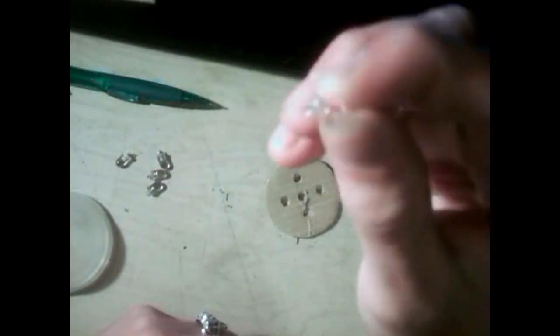Now when you go to wire your LEDs, make sure that you've got your positive and negative correct. Since this is a scavenged LED, the way to tell is that on one of the sides it'll be flat, that'll be this side, and that's your negative side. You always want to put your negative to the negative of the battery, and then your positive to a resistor first before you plug it in. The reason for that is if you reverse wire an LED, in almost all cases, especially if you're using a 9 volt battery like I am, it will burn out the LED.